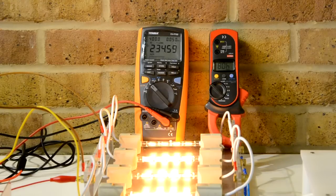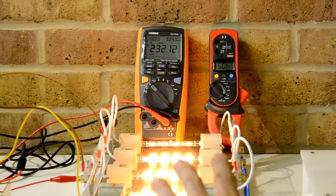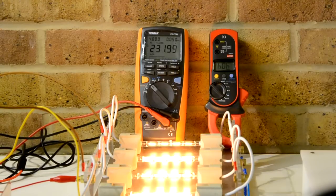The system is very, very sensitive to voltage and current. I can tell you I did connect many various combinations of bulbs and I lost many of them as well — they blow out in an instant. However, you cannot use 500 watt; if you have almost no resistance, it's no good either — you're just shunting the power into the ground and you will not get any kind of feedback from the system. So this seems to be a good start, however it is not good enough — I will have to increase the number of bulbs. 240 volt, 0.4 amp — that's about 55 watt currently drawn from the system.